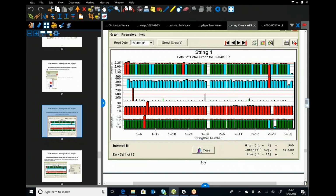The only thing that I would like to add, and you did a lot of great information, is that the one thing I see when I'm out in the field all the time is a sense that DC is safer, or there's a lack of the respect that it needs. That simply cannot be further from the truth. There's a whole list of different PPE that is required when we're doing a lot of this testing. We do have a DC safety test kit that's got a bunch of additional PPE that we normally don't have, for example, aprons, face shields, that kind of stuff.